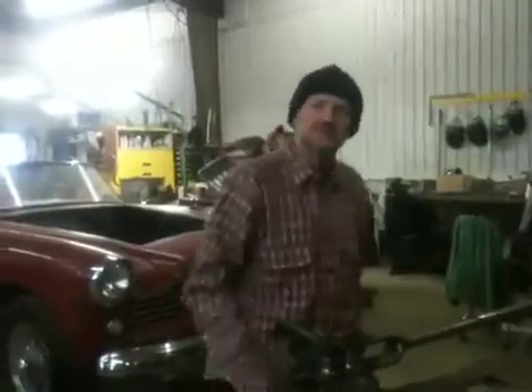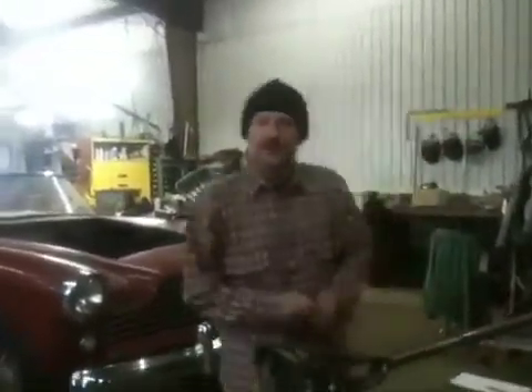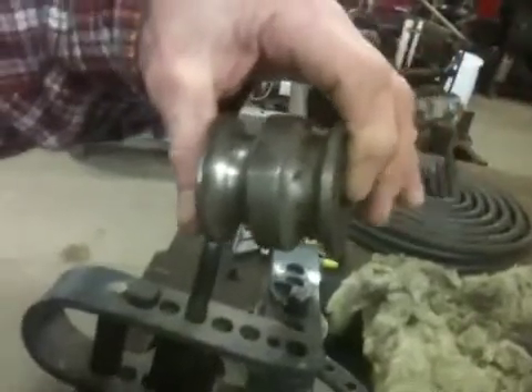These bench benders are made to just bend flat stock and wire. We made these dies on the lathe so that we could bend the pipe — just a regular carbide bit, formed into whatever diameter we needed. We profiled the bit to get this done, doing one side at a time. There are two different pipe sizes: one-eighth and one-half in one set, and three-eighths and one-quarter in the other. It's just a chunk of cold-rolled steel.